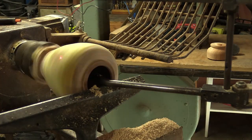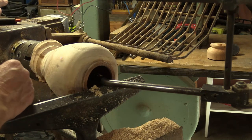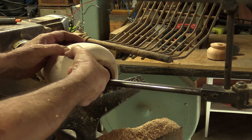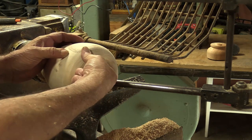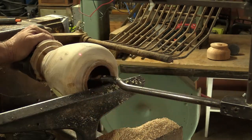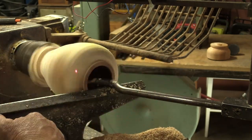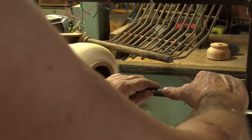I don't wait for the laser light to drop off because I know I've got that extra room. I reach in here and I feel it — all the way up it's got a nice even wall thickness and it's very very smooth because of that round high-speed cutter. I continue to work my way down. I don't have to wait for the light to drop all the way off — a lot of people do that, but I don't need to.